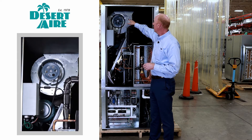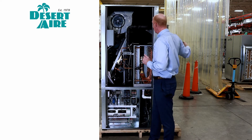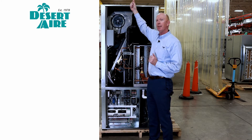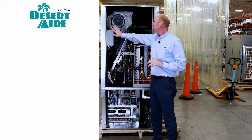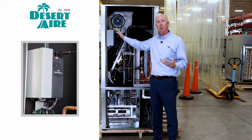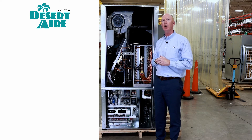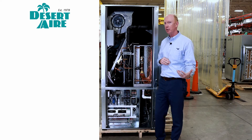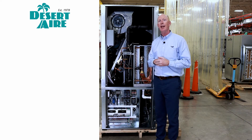Moving through the unit, you can see we've got our blower and motor mount inside. It's a top discharge unit, so we're going to come in from the grow room, go through the unit and treat it, go out the top, and then have ductwork turn and go right back into the room. There is a VFD on this — we do utilize variable speed airflow on the grow units. The reason for that is we can increase the airflow for points in time where there's high sensible demand, and we can slow the unit down when it's a more latent load.